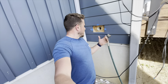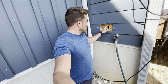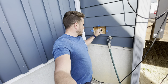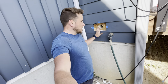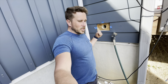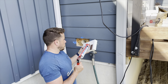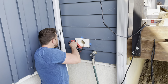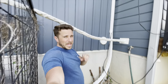The boring of the hole is done. Now I need to hurry up and get this thing back on here. I'm going to have some elastomeric caulk to seal around this hole as well as around the top and sides of the box — for water intrusion, to help even though I got the house wrap back here. The caulk should still help, leaving the bottom open just in case water does get back there, so it's still able to get out. But I want to hurry up and try to get the line sets through here and get this closed up because I don't want to leave just a huge open hole on the side of my house.